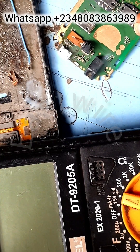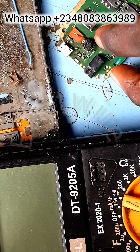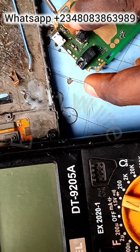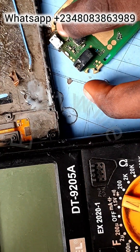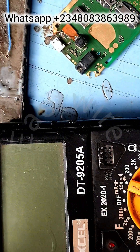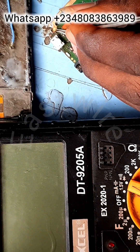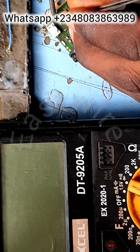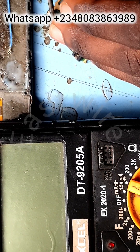I've done these jumpers on this kind of phone more times than I can remember, across many videos, so I hope this won't be new to you. Taking the jumper wire to the GND — the ground, which is the earth of the body of the phone. That's what I mean when I say earth or GND: the body of the phone.